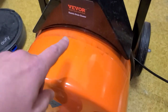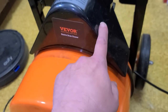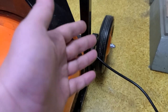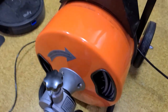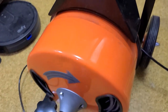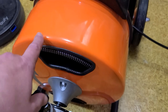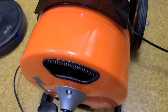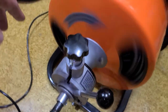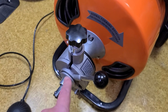It's pretty simple because it's just an induction motor and a V-belt that runs around the back of the drum. There's a little stanchion where you adjust the tension — it doesn't require much tension because there's a whole bunch of surface area. It has 8-inch casters with ball bearings — very simple ball bearings, but at least it rolls pretty easily, especially considering this is a 100-pound unit. The biggest drawback is this front lid or front half of the drum wasn't put on particularly straight, though it's good enough. These machines are kind of wobbly in general to begin with, and you have a foot switch that you can easily turn on and off while managing the cable.